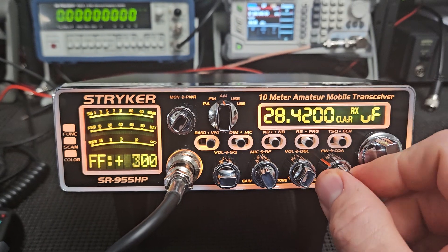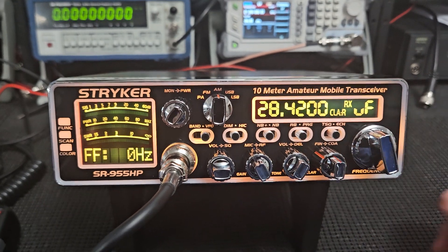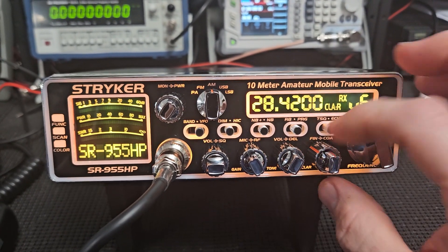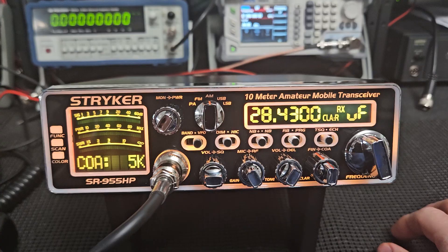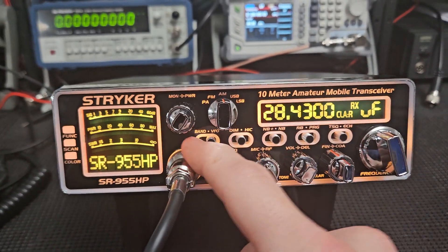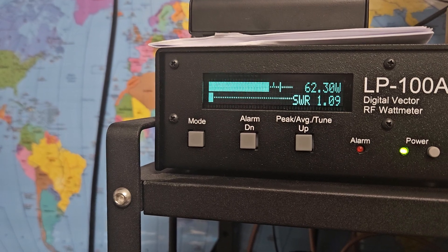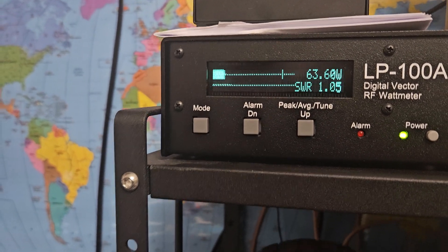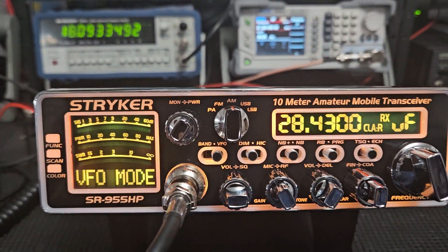This is receive only — plus or minus 300 hertz — so if someone was slightly off frequency you could dial them in. This doesn't have to stay at 12 o'clock; this is now a VFO with 5k shift. I'm going to show you the power of the radio where it was really designed to be used. Switching back — about eight watts of dead key, one two three check — that's about 60 something watts, which is what they always do. RF power all the way up, this is AM by the way.